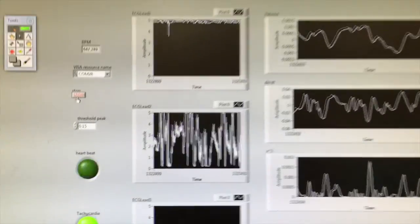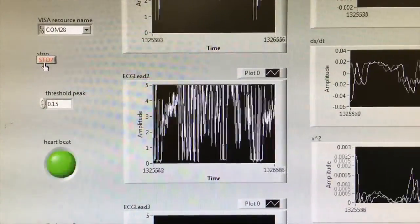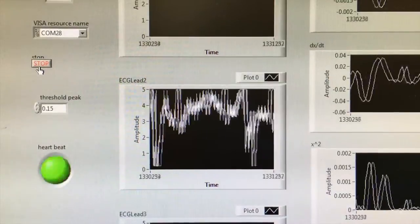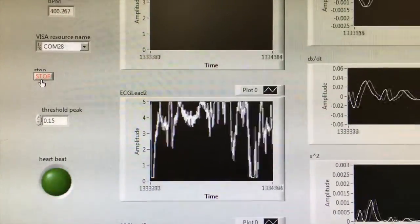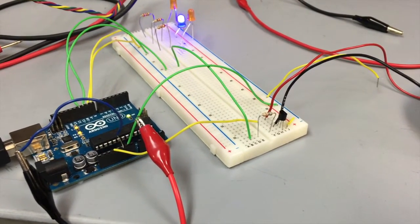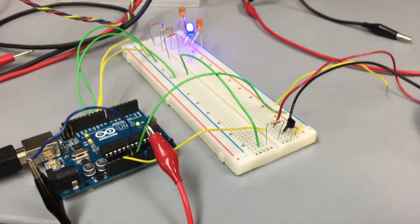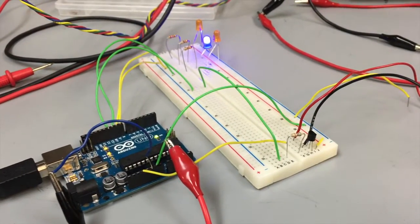Here can be seen the type of noise that can be on the ECG lead if there's a lot of movement. Right now the athlete is not trying to stay still, and the signal has a lot of motion artifact noise from it, and no BPM can be clearly read. On an earlier portion of our video, whenever we have the ECG hooked up to an actual athlete moving on a treadmill, the noise actually ends up being a major issue that messes up our BPM calculation, and therefore the rest of the circuitry doesn't really want to go along with it.